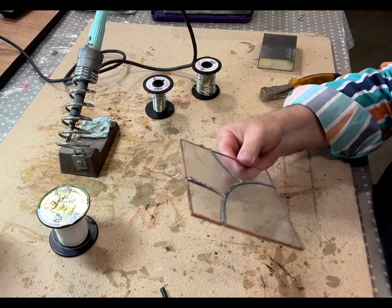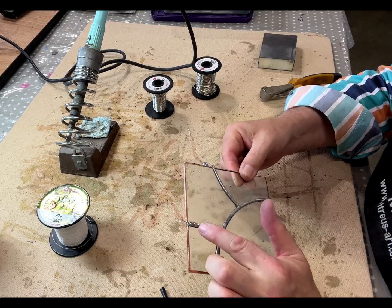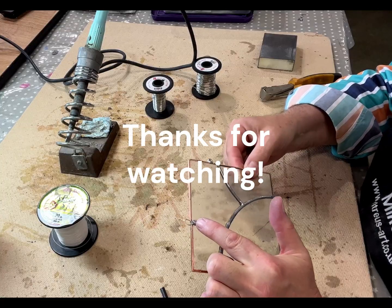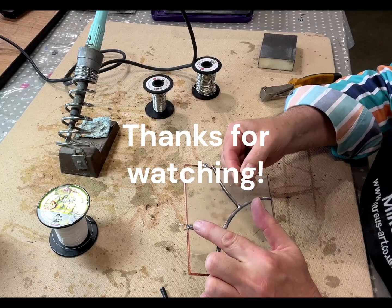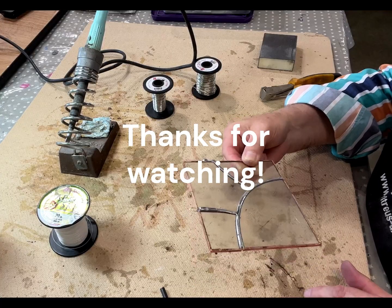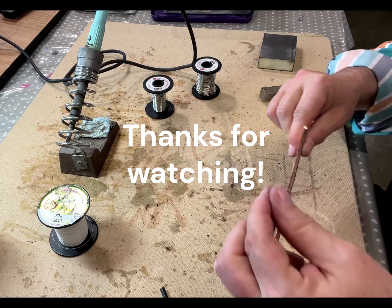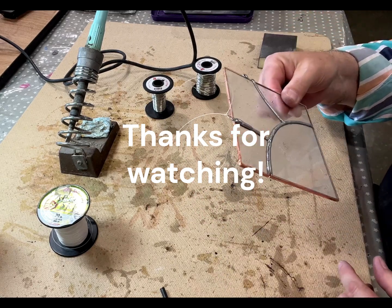So based on the fact that you can only hold 2 things at once, we add a little blob of solder to the bead, a little bit of flux on top, then we melt the wire loop into that blob and tidy it up if we have to. Hope that's been useful. Happy wire loop making.